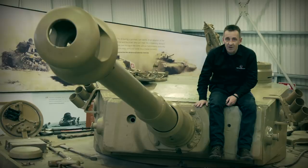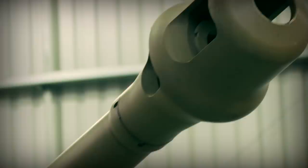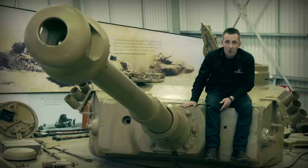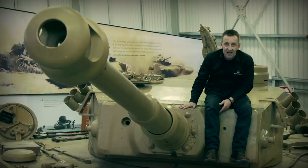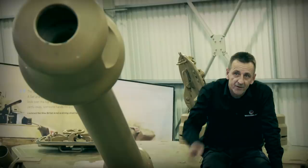The thing that really made the Tiger 1 very distinctive and very impressive on the battlefield was the use of the 88mm. This was based on the anti-aircraft gun, the Flak 36, and actually Hitler himself insisted that the Flak 36 was mounted onto a tank chassis. This caused huge problems because the recoil was absolutely intensive. What you will find on the Tiger 1 is use of a hydropneumatic buffer and a recuperator, very similar to what you get on modern main battle tanks. The armour of protection made it almost, in the initial stages of the war, almost impervious to anything the Allies could throw against it. At its thickest part it is 100mm, using rolled homogenous armour — the rolling process made it toughened and stronger than anything else the Allies had at the time. Also, while talking about the recoil produced by the 88mm, you find at the end of the barrel the very distinctive double baffle muzzle brake. This reduced almost 70% of the recoil inside the turret, and it was so important that if it was damaged during operations, the crews were told not to fire the main armament.